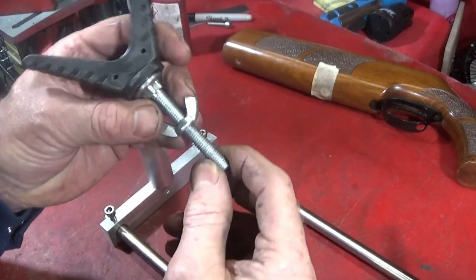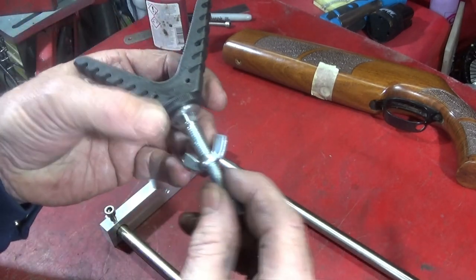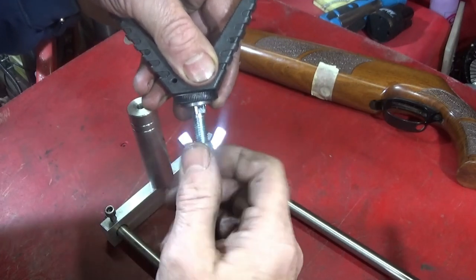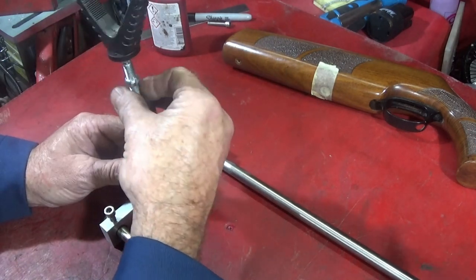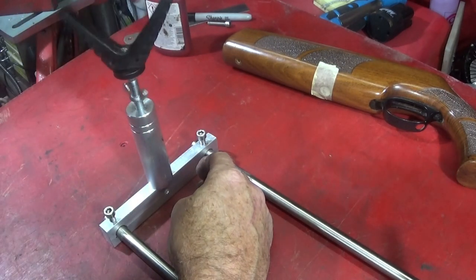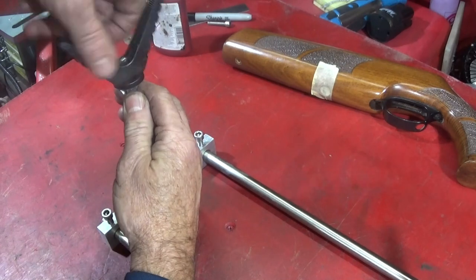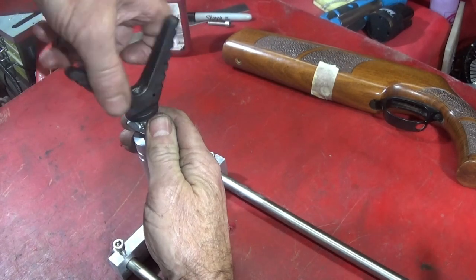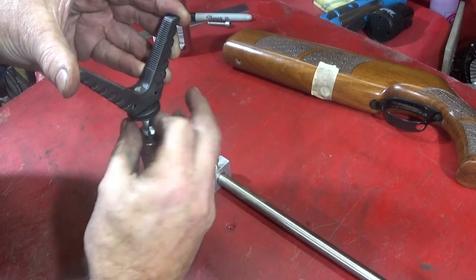And then lastly on this part, I've sawn it to length. I found out the ideal height to give myself a bit of adjustment up and down still. And then I put an 8mm butterfly nut on like that. Then this one screws into the aluminium riser part, and you can set the height then. I'll screw mine right the way down. Line it up and then lock it up with the butterfly nut.